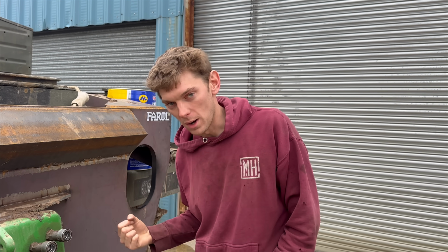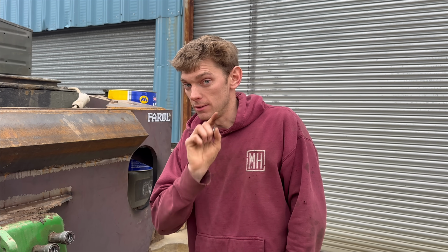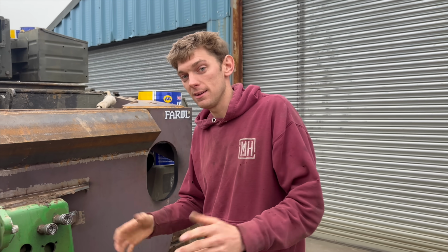So then halfway through the ploughing match, I no longer had control on the remote. I had to go underneath, pull the wires out and cross the wires to make it go up and down and flip the plough, which was not ideal. But we managed it. So if you're listening, Flowfit, I could do with a new remote and brain because I blew it up. Not your fault, my fault. I'll have to put a voltage regulator on it, but you know, you live and you learn.